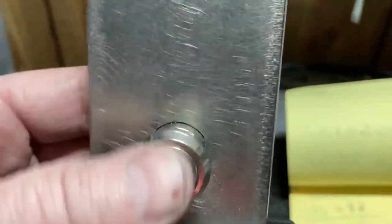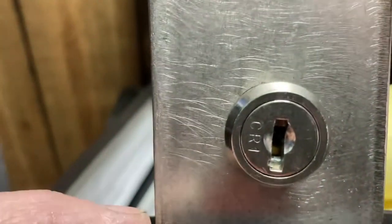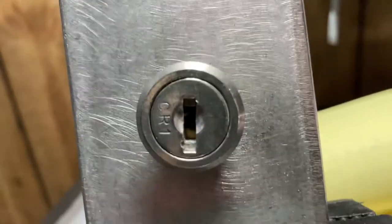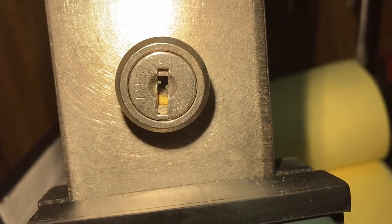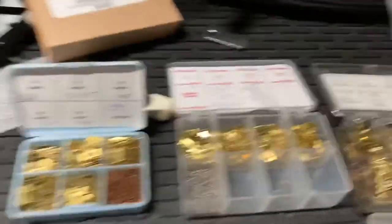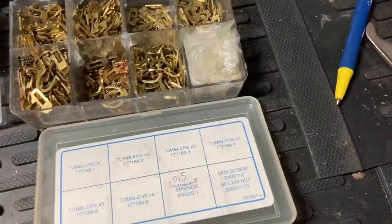I have a customer where the lock is pressed in on the back — you can't get all the way through it, can't take it apart because it's in a cabinet. You don't want to drill it, and maybe they're all keyed alike, so you just need to get one key made. You go ahead and reach in there and you're able to look in there and figure out what the wafers are. You can also use a marker to cut the glare. Get down to eye level so you can actually see inside, and put your light on top so you can see all the way to the back. After you do a few, you start getting the idea of how much movement you're actually getting out of these wafers.